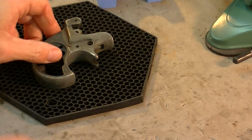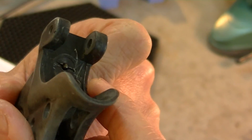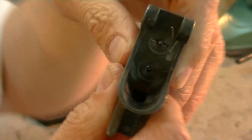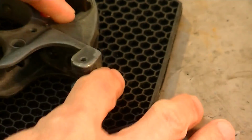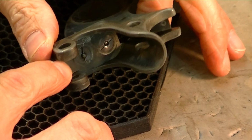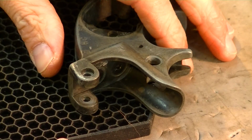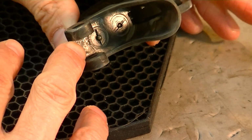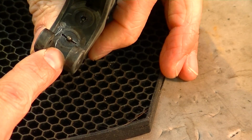Now on this little Derringer, like what I had shown you all just a little bit ago, you can see where somebody has really gotten in there and they tried to get those plates off of there. Well, what we're going to do is get them out of there the right way. The first thing that I've done is I put this down the ultrasonic cleaner, and that ultrasonic cleaner really gets down in and lets you, it'll get a lot of that, I call it dirt glue. It's where it's just got dirt and just, you know, for however many years of stuff getting caught in there, it's glued it. That helps a lot. A little penetrating oil will help. Q20 makes a good penetrating oil. Then the other thing is just knowing how to get it off of there.